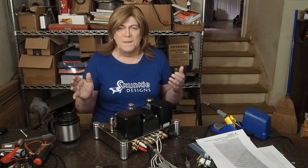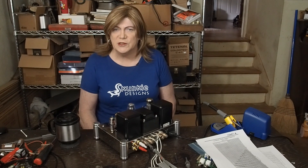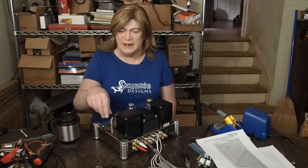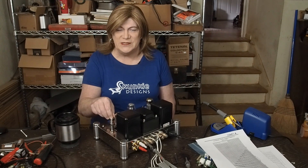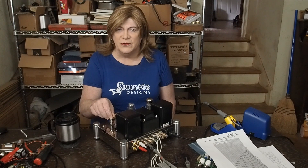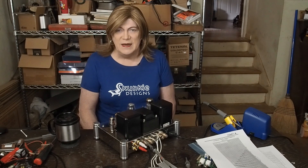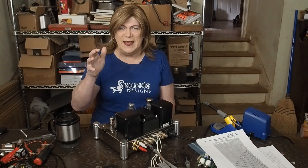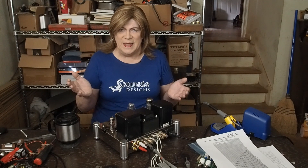It's got so many issues. Why are they paralleling a 12AX7? The EL34 doesn't need that much current. A 12AX7 is basically two 6SQ7 triodes in a single bottle — electrically they're very similar — and one side of a 12AX7 has lower plate resistance and should be able to drive an EL34 easier than the 6SQ7 did, no problem. In my experience, paralleling tubes is never ideal — it never works as well as a single tube that can handle the current and power needs. It's just unnecessarily complicating the design.